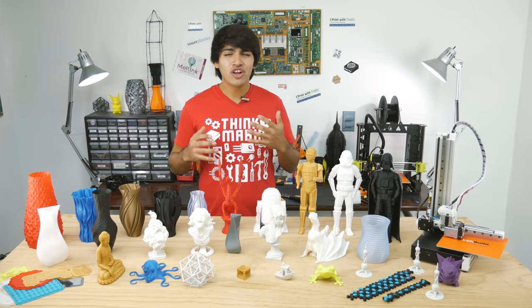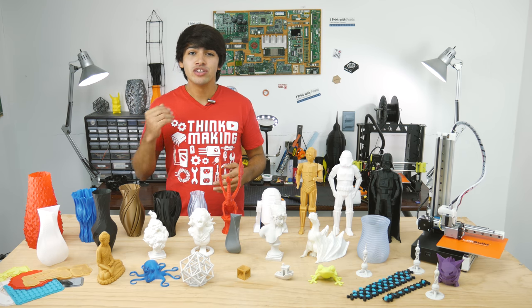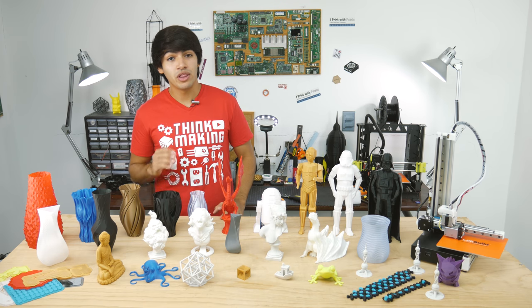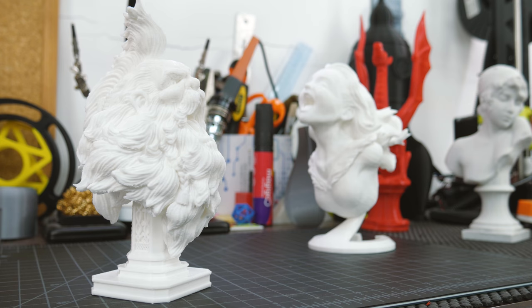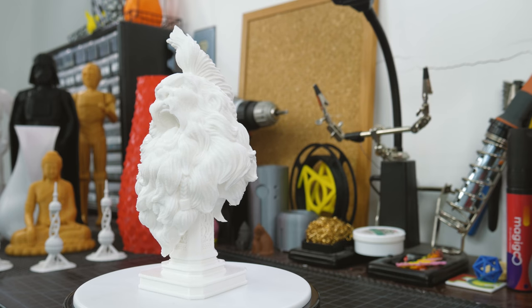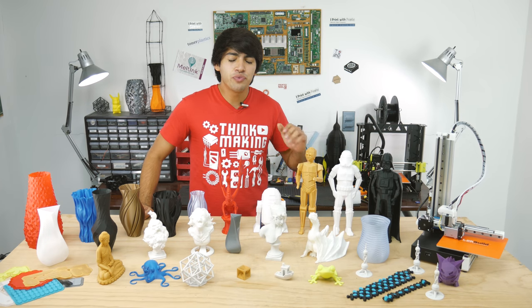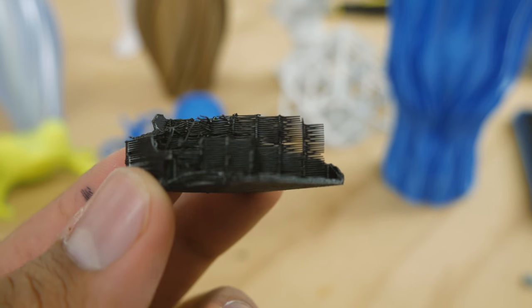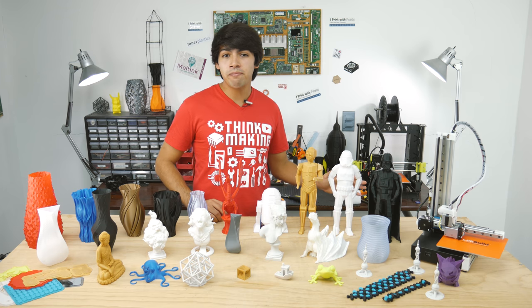I also tried making a small vase with a 0.6mm nozzle, and I can confirm it works flawlessly — and those layer lines, oh my god, they look beautiful. That's not quite the same story for the 0.2mm nozzle though. In my case it seems like the path is just way too small and the extruder doesn't have enough torque to push the filament through. Yet there are many users that have been able to print with this nozzle, but for reliability's sake I'll stick to the 0.4 and 0.6mm nozzles. In the looks department, this printer is able to print beautiful models with very small details, super steep overhangs, great reliability, and outstanding surface finish. But I noticed something strange in my first print — the infill is done in a strange way. The infill has many gaps, which results in a weaker infill and therefore a weaker print. That's why for now I don't print things that need to resist very strong impacts on my Cetus. Thankfully, this is something that could easily be fixed through a software update by the Cetus team.